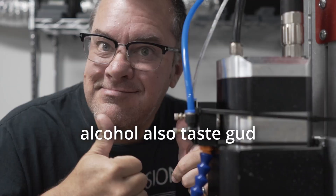What I found is the denatured alcohol was really irritating my eyes — they were on fire the whole time, and for days afterward I'm still having repercussions from it. I eventually had to switch from denatured alcohol to more traditional coolant, which just makes a bigger mess. Traditional metalworking coolant is oil mixed with water and other additives. You mist it on, the water eventually evaporates, and it leaves an oily film everywhere.